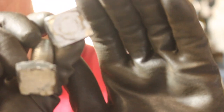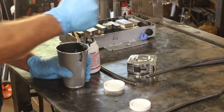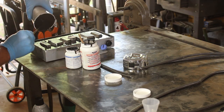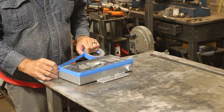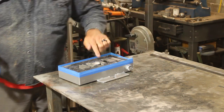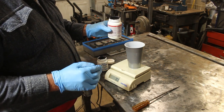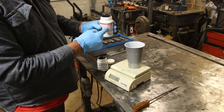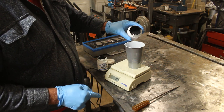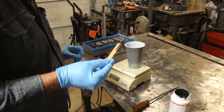Those fit the T-slots in my drill press table perfectly. Back to the epoxy fill — we'll mix up another batch and get this thing topped off. It's still not enough, so for this final layer we'll put a curve around the edge using some masking tape, then fill that right to the edge. I know the ratio is two parts of this to one part of that, so I'm using a scale to measure — five ounces looks like about half of it; hopefully that's enough.